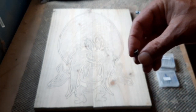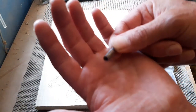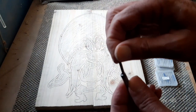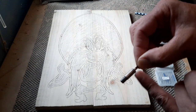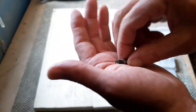However, for my 1/4 inch router, you need what they call an adapter reducer collet, 6.35. It's basically just a tube to make your shaft that 1/4 inch, and you literally just slot it in like so into the silver end, and the dark section goes into your router. That's now got a 1/4 inch shaft on, and we're good to go.